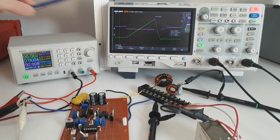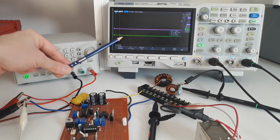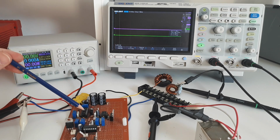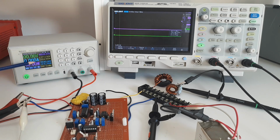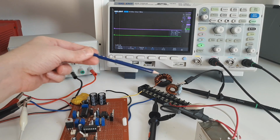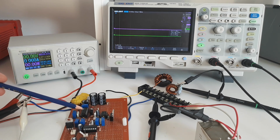We want these straight lines on this triangle, because that will make our calculation of the area of this triangle more accurate. So in order to make these measurements to calibrate our current probe, we're concerned with two measurements. One is the current on the scope, and the other is the current which we measure on the power supply. Now, it's important to remember that the board itself and all the chips consume current. So first we have to measure this tiny current, or quiescent current, and then subtract that later from the main current which we're going to measure. In order to do that, all we have to do is disconnect these power lines from the power components. Then our board will not be consuming any large currents or power, and only the chips will be consuming power. Then we measure that current. I measured it before, it's about 34 milliamps, and then we can subtract that from our main current measurement.